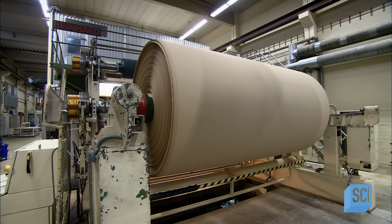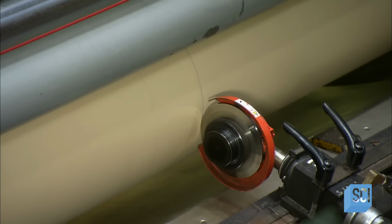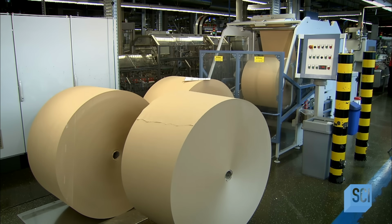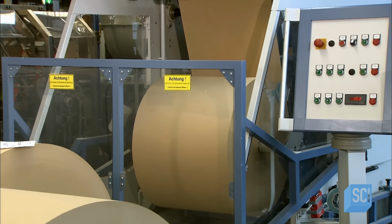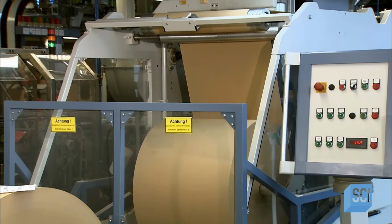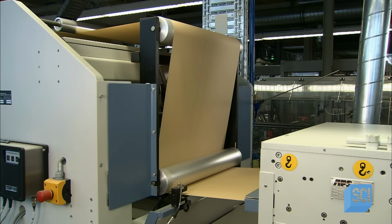It takes the machine 45 minutes to produce an 18-kilometer-long roll of filter paper. The next step is to transfer the roll to a cutting machine, which slices it into 5 narrower rolls, each 60 centimeters wide, to fit in the filter-making machine. As the narrower roll enters that machine, a sensor verifies that the sheet is aligned correctly.